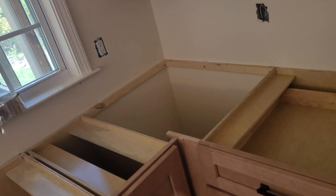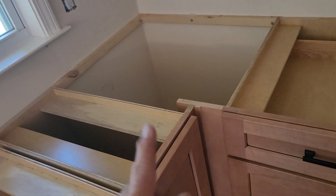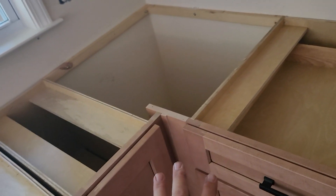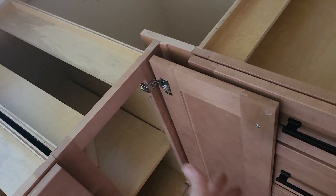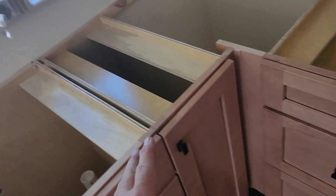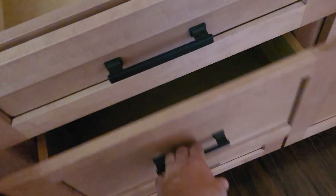Anytime you have a really close corner and you think you need 27 by 27 to make everything work — not exactly. There's always an exception to the rule, and this is it. Here you've only got a one and a quarter inch filler on a full overlay cabinet layout, 27 to the side of the cabinet. Because of the pivot point of the door, it opens at 90 degrees, nothing conflicts, and you've got perfect use of that corner with the voided cabinet.